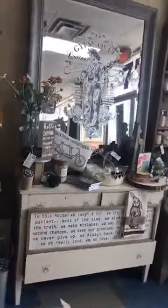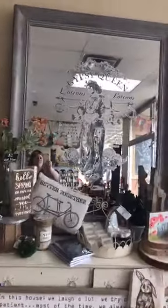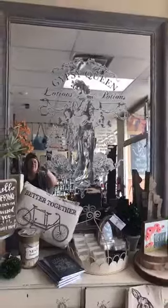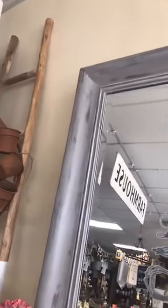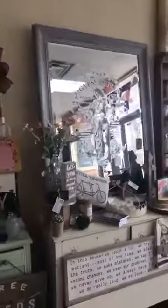We painted this mirror frame — it used to be a bright gold, picked up at TJ Maxx. The color scheme is a base of Honfleur (a milk chocolate brown), then a layer of French Linen (a taupe-y gray), then a wash with old white. For the wash technique: take equal parts paint and water, brush it on, wipe back strategically leaving almost a haze, then lightly sand to distress. The transfer matches really well with that color choice.